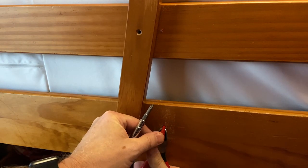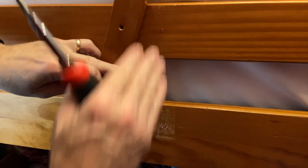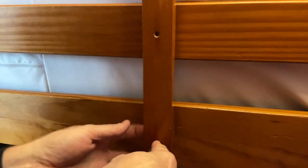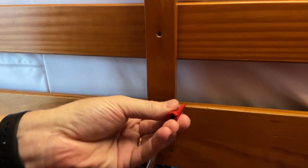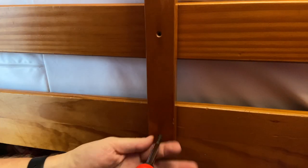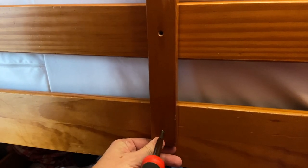We'll cut it, and if it's in a two-by where you have it in farther, or in a wall, you might be able to snap it — sometimes that will work, sometimes it may not. So we have our two pieces in there and we're going to try it. We're going to line up the bottom one first because it might be a little more difficult. I want to try to get that screw going right down the middle because it is hollow all the way through, so the screw can go into that plastic and push it to the sides so it will expand to grip into the wood.